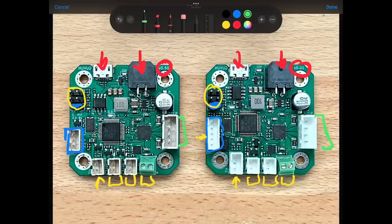The 0.61 version has the ADXL accelerometer built into it, which is a really big benefit. Every time I've had to put the accelerometer on my tool head up until now, I'd mount the sensor, try to find the cable I made a few months ago, couldn't find it, recreate it, and then figure out what pins go where — it takes maybe an hour. With the accelerometer built in to the 0.61 model, you can just run the input shaper tuning process anytime you want. If you loosen your belts and put them back on, instead of guessing at the tension, you can just run input shaper again and validate everything is good.